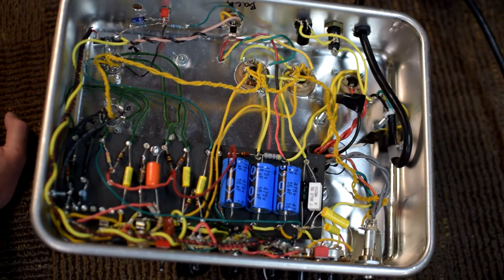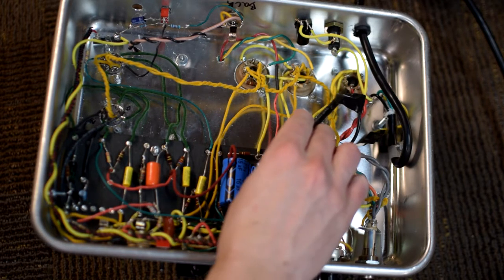Typically, those high voltage lines are rated for 100, 200, maybe even 300 milliamps of current, depending on the type of power tubes you're going to supply. This amp is running 6V6s, and an individual 6V6 needs roughly 45 milliamps of current flowing through it. So that's 2 times 45, that's 90. So already we've talked about 100 milliamps of current, maybe even a little bit more than that. And that's the maximum output rating for that high voltage. So you could have 350 volts AC at 120 milliamps of current flowing on that high voltage line, coming off these red wires here going to our rectifier.